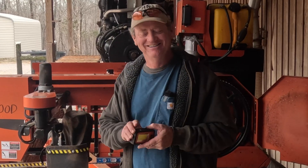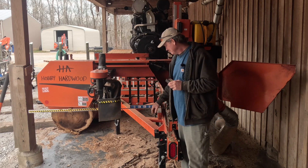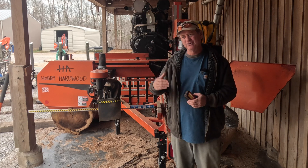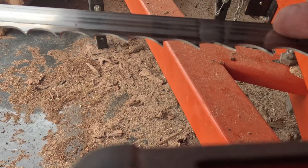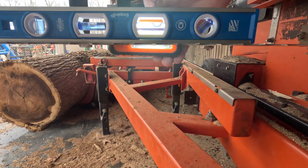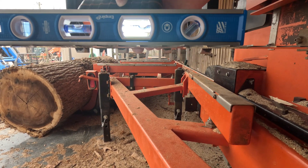So I know this one's right because I can hear it, but I wanted to show you another way to test it. It's actually pretty straightforward. You find a light, you put a straight edge on the mill — because you've got to take the curvature out of the band. You lay a straight edge on top of it, put a light behind it. If there's any mis-grind of the weld, you're going to see light coming under the weld. If you can't see any light, that means the level is sitting straight on that band and that weld is a good one. So we're going to check this guy — there's the weld, can't miss it. I'm going to put this straight edge right on the weld, shine the light behind it, and you'll notice there is no light coming between the weld and the band.